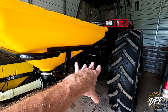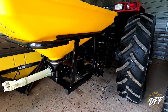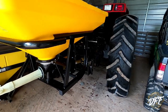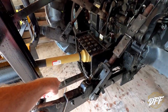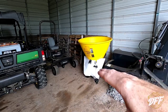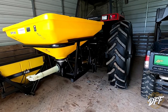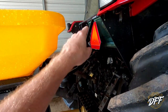The new pendulum spreader still flung a little bit of stuff at the tractor, but it was probably 15% of what the spinner spreaders throw — way, way better. It's also easier to load. What I normally do is lower the three-point hitch as low as possible to make loading bags easier, and this one, being a much taller design, was still over a foot taller even when dropped down. So the design of this was definitely better for loading.